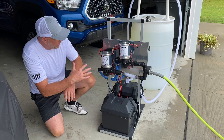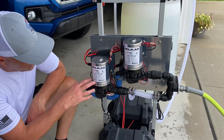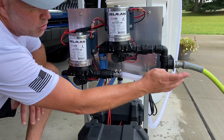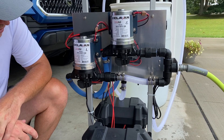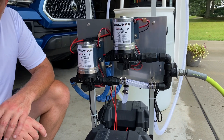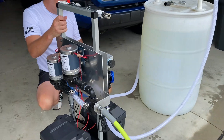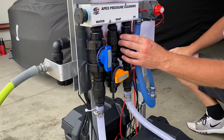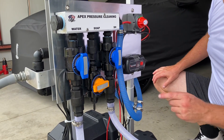So here it is. What we did is we have Siamese, so to speak, two Delavan 7 gallon a minute 100 PSI pumps. They both feed into one outlet and we have a 5/8 Flexilla garden hose on this particular unit at the moment. We have one of our 3/4 inch big flow proportioners with 3/4 inch metering valves for both water and bleach, and a 1/2 inch metering valve for soap.